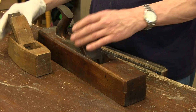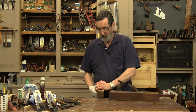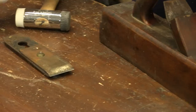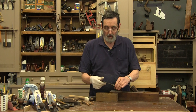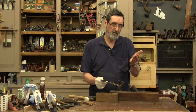So here I've got a couple of planes. Restoration for this one is basically the same as this one. What you have on these planes is a wedge that holds the blade in the plane, and you've got a cap iron and an iron. When I'm looking for a second-hand plane of this type — a wooden bodied plane — I'm looking for a cap iron and a main iron. The cap iron, sometimes called a chip breaker, is really a diverter. It diverts the shaving up and separates it from the main body of wood as you're planing, and up through the throat of the plane.